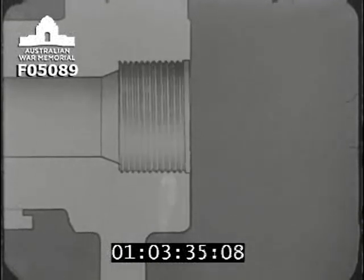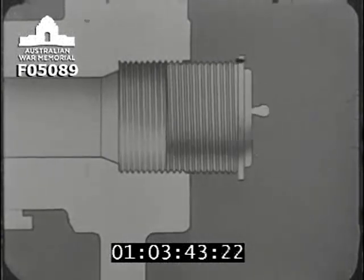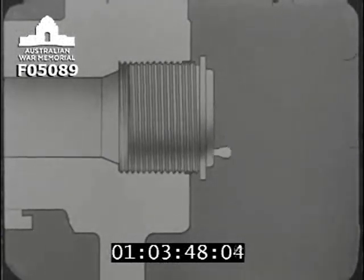One way of providing a very strong means of closing the breech would be to have the inside of the breech bush prepared with screw threads, and then to fit a large screw into it when we want to close the breech. But this takes a long time, since it means completely rotating the screw many times to engage it fully.